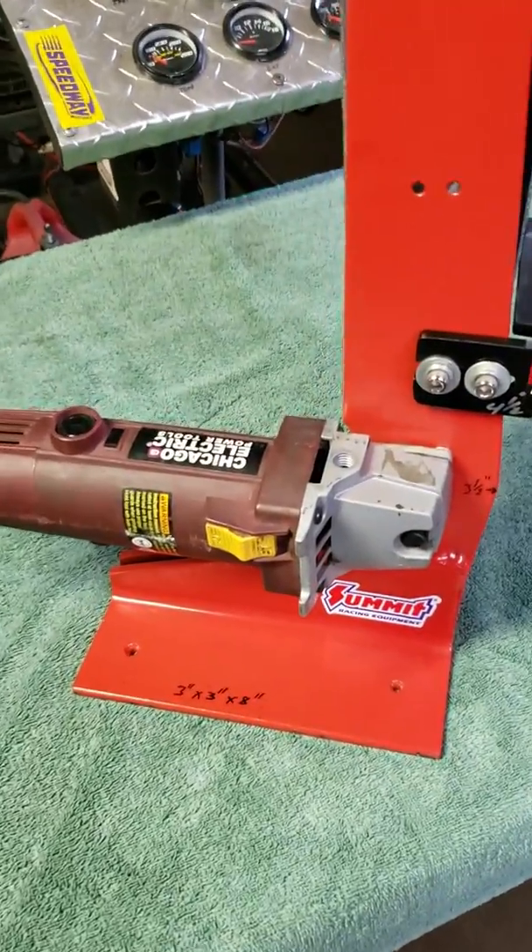The main vertical support that goes up through there is twenty-two and a half inches long, measured from the bottom of the table to the very top of the support. The widest part of the support at the bottom is three and a half inches. I had to add an extra piece here to get the pivot point correctly — I needed to extend that back for the proper offset. That extension is four inches from here to here.